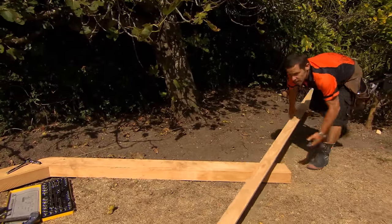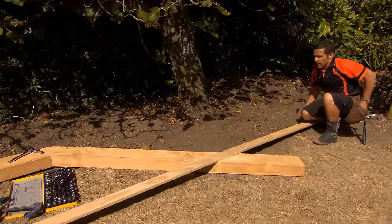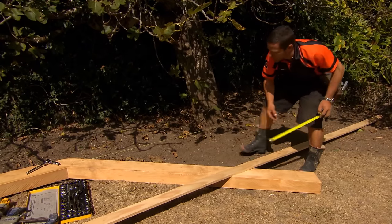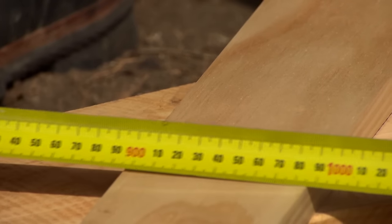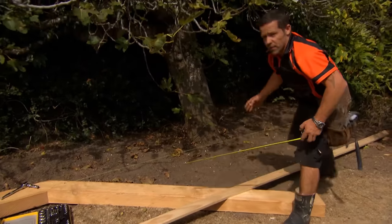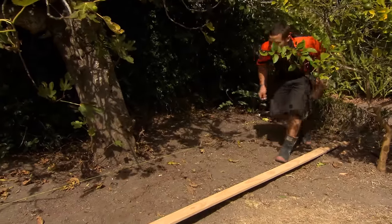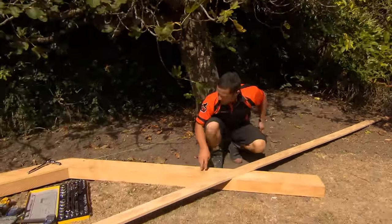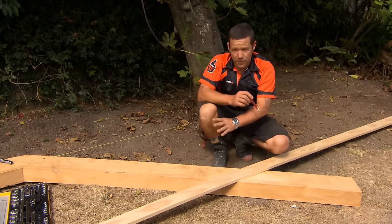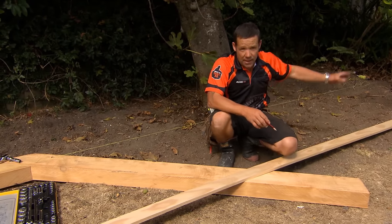I've got a long length of timber, and I'm just going to lay that down and use this to get parallel off our string line — I'm going to be 900 millimeters away from our string line. Let's just measure 900 mil off our string line, then come down the other end and make sure that we're parallel. What we're going to do is use our board just to mark on our sleeper here. I know that's going to be 45 degrees, so I can just rebate that out exactly the same as the other end, and pre-cut and do all the others ready for our next step.